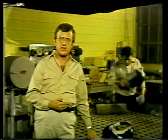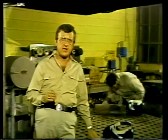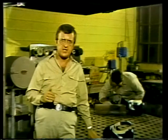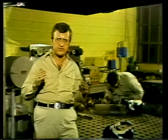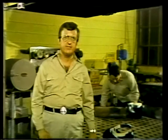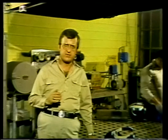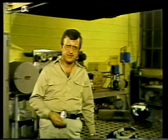You see, arc welding is done every day in plants like yours to repair all kinds of equipment and connecting systems. It is the process of applying sufficient heat to two separate metal surfaces to make them melt and fuse as one solid piece. Electricity provides the heat source, and electric arc welding is referred to as fusion welding.